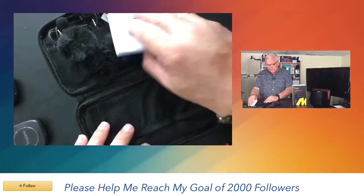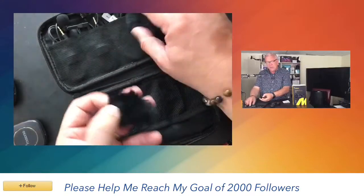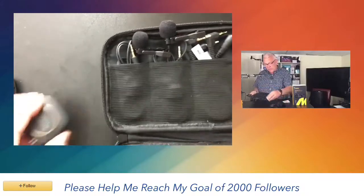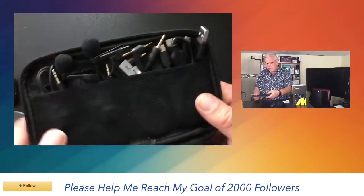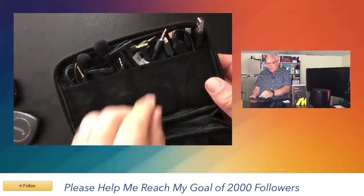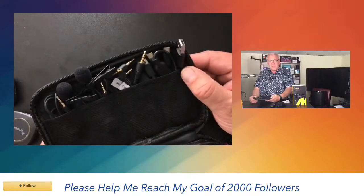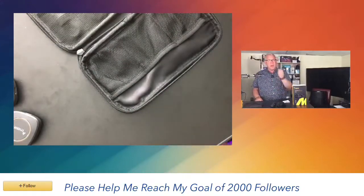You've got the instructions, three wind muffs that clip onto the transmitters to minimize wind noise, and two lavalier microphones you plug directly into the transmitter for a more discrete microphone and more direct sound. You've also got two cables — one TRS to TRS for a DSLR camera, and a TRRS cable for smartphone devices or tablets. And one cable charges all three devices at exactly the same time.